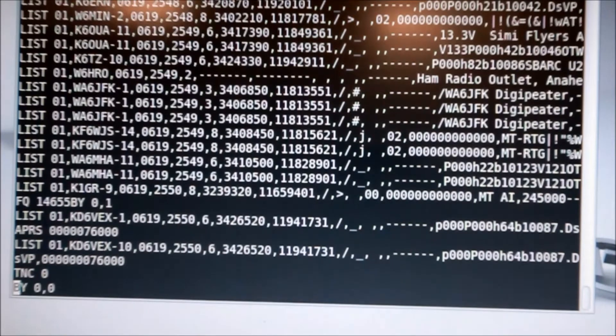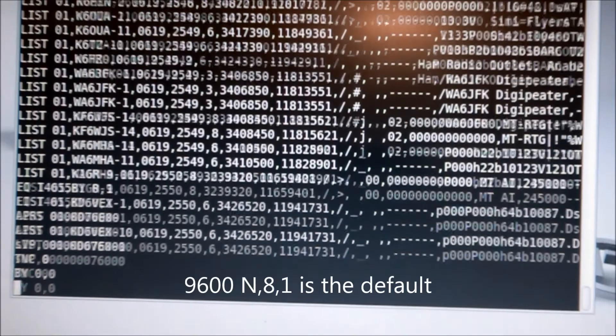The first thing I've done here is I just turned the TNC off. If you look down here on the left, this is just a serial port. TNC0 turns the TNC off; TNC1 actually turns the TNC on. The big magic trick to getting these to work was I had to do a long reset on this — if you hold down the reset key for five or ten seconds, everything comes back. And if you log in with the serial port, it will actually respond.